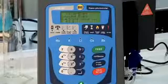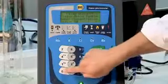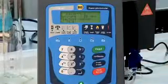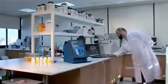There are three types of calibrations: single point, multi-point, and multi-mode. We will start with the most common type, the single point calibration. The single point calibration involves one standard and a blank to set the zero point. Of course, all calibrations require a blank to set the zero point. Let's do a single point calibration of potassium at 50 ppm, and while we are calibrating we can use the FP PC software to follow along.